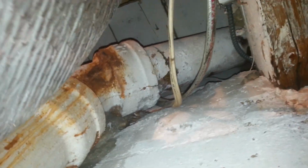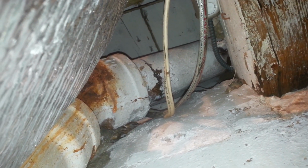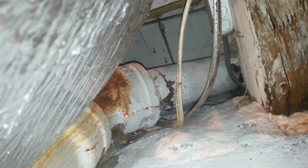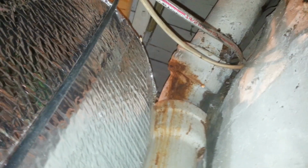The reason that's dripping is because I cut the stack already. I don't know if you can see the line just above the eighth bend. That's where I cut it with the soil pipe cutter. I had just barely enough room to get the snapper in there, and that's where it cut. So that's why it's dripping just a little bit, which is normal anytime you cut a drain.